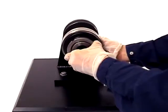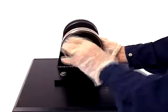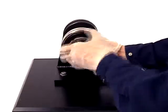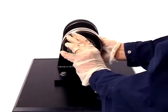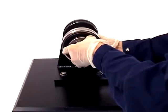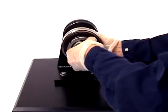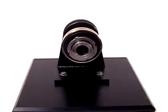Continue to tighten the nut, just enough so that the self-locking sleeve makes full contact with the shaft and the sleeve is firmly in place. Do not drive the bearing any further up the sleeve than necessary. This is important. If the bearing is pushed too far up the sleeve, it can decrease clearance in the bearing.